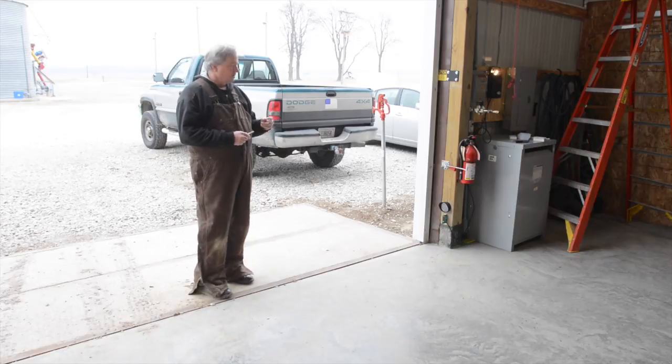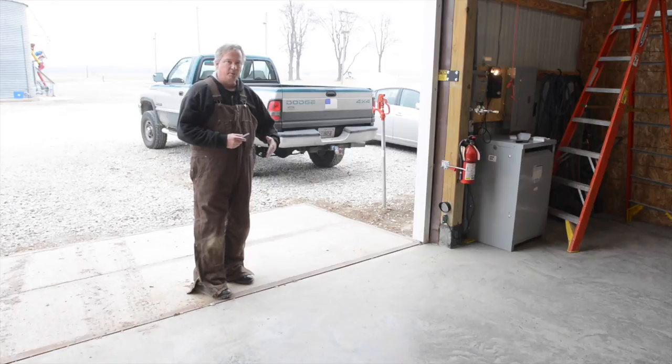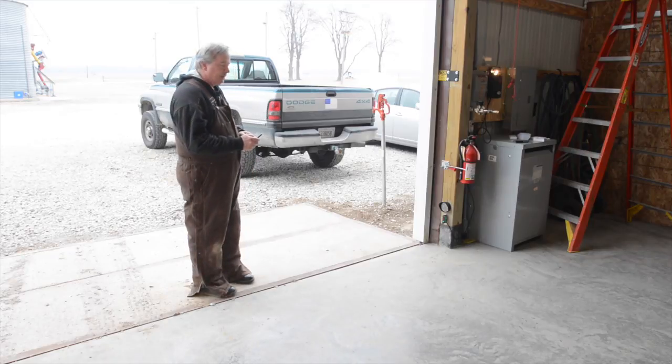Operators come with two safety features. The photo eyes would make up one feature, but there's also another one called object detection. So if the door were to hit something, whether you trip the eyes or not, this door is going to hit it about 5 pounds of pressure or less in reverse, much like your garage door at home. So I'd like to demonstrate that now.